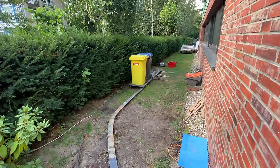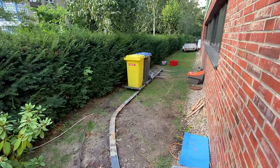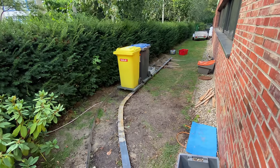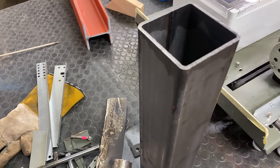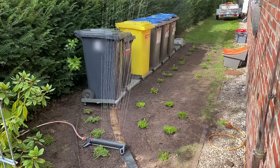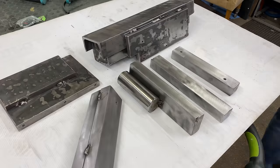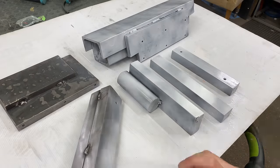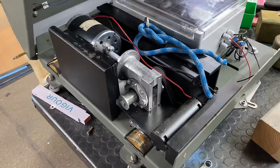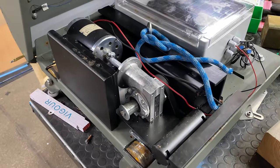The belt drive has more torque but it also needs more weight to put that torque onto the track. So I took all the scrap steel I had, put it into box section, and welded it up just to create some weights — because especially when the train is wet it has very, very little grip. I just didn't think about it: you need so much weight, and that's why real trains weigh like 50 tons.